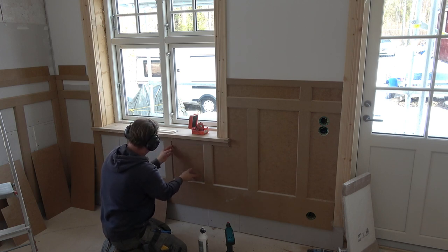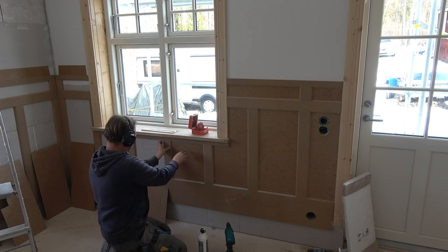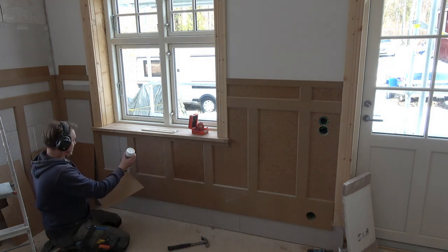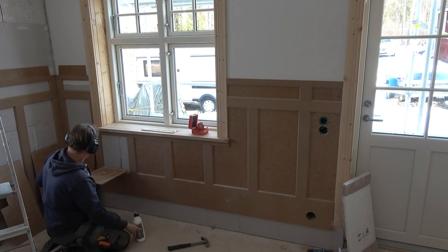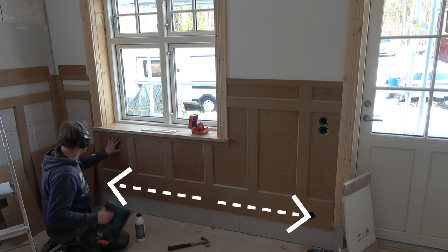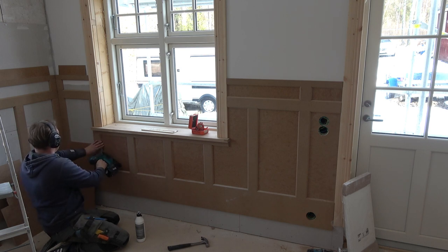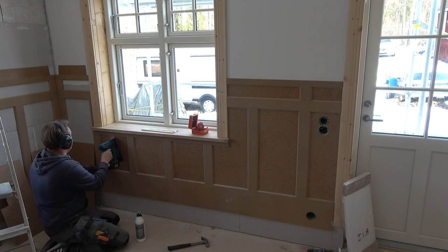When you make a panel like this, you can't take shortcuts by gluing moldings in different patterns — it won't turn out well. So how do you start? You must measure and plan so that all the compartments on the panel are approximately the same size. This is what can be difficult as all the walls are usually different lengths. We also have windows and doorways to think about. You have to make a decision depending on how the walls and windows are — you can either let the panel or the openings decide the pattern.